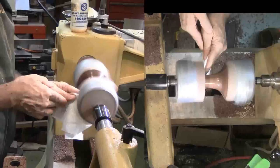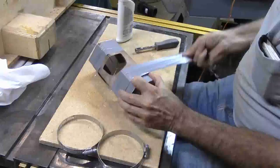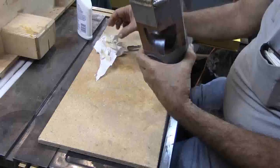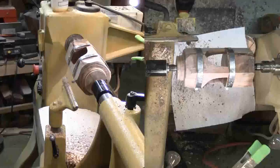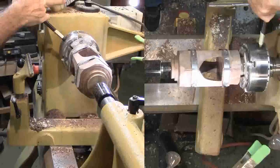Now it's time to turn the staves around and glue them together. I've taped off the finished surfaces and carefully trimmed the edges of the tape. I want to be able to remove any glue squeeze out with the tape. But just in case, I'll use white glue to glue these together — then at least any squeeze out will be transparent. Then remove the tape while the glue is still fluid. Now I'll leave the band clamps in place while I turn tenons on the ends. With the wood still in the chuck, the jaws will hold it together and I feel safer removing the band clamps.